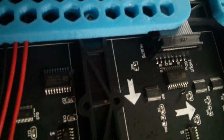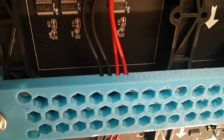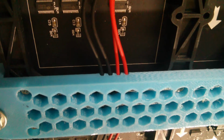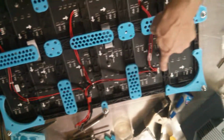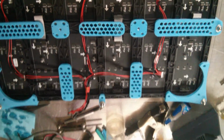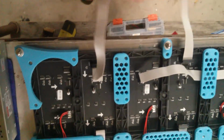Over here, similar to this cutout strategy that you see on the left with the ribbon cable, I did another cutout strategy. Maybe this side. So I did a similar cutout strategy for the wire that I was intending on using. That's just 4 cylinders, again arrayed. Just create the cylinder of the proper dimension, run it through your piece, and in this model's case, I ran it vertically all the way through, so it was one single set of cylinders that ran through, and I just did subtractions on both. By doing it that way, you ensure that they're not offset in some strange way that you have to deal with later. So these are the 3 cables that are coming out of the thing.